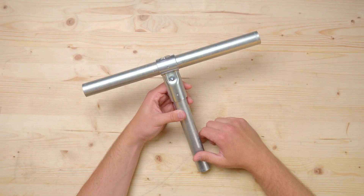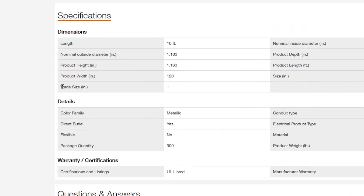Of course, the Pro connectors work with 1-inch EMT conduit right out of the box. You might think any 1-inch diameter pipe will work and there's no need to watch the rest of the video — but wait, that's not the case. The '1-inch' in the name is not the actual outside diameter of 1-inch EMT conduit. This is what's known as the trade size.